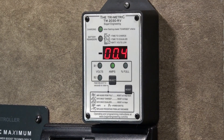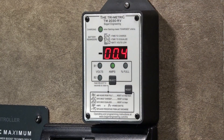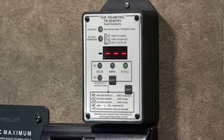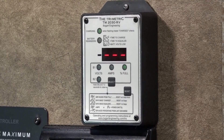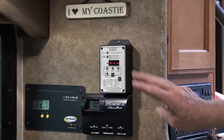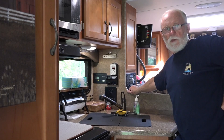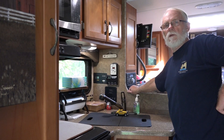If there was a discharge from the batteries, we would actually see a minus sign here. This number will change depending upon how the clouds are affecting the solar panel. If I toggle again, the straight lines tell me it is full. As the battery goes down and we start discharging, I can actually see the percentage of the battery. Those are only the first three parameters — there are actually 22 different parameters, including alarms that can be set for high and low voltage. That concludes today's installation. Thank God.